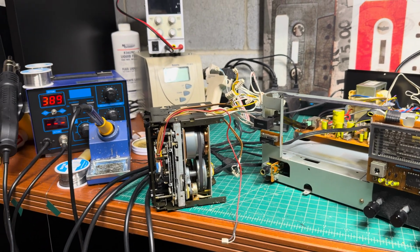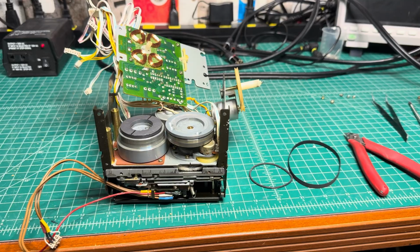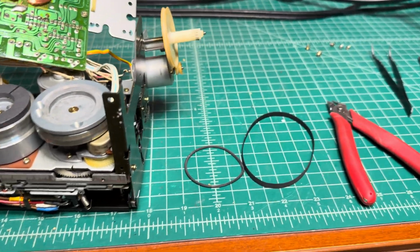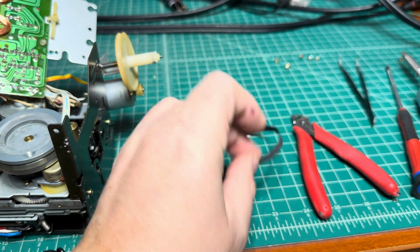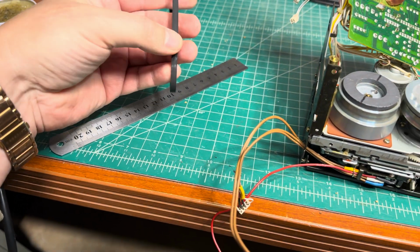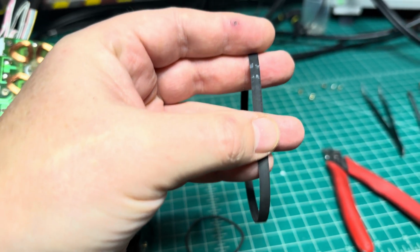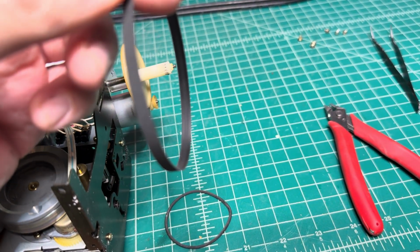Probably it will take some time to pull the spare tape transport to work with this one. See you soon. Alright, working on. All zip ties original, all lubricant original, and belts original with original mold on them. Alright, this belt I just measured it with my ruler. It has 120 millimeters half length. So that's how original belt looks like. It's polished inside already, as you may see.